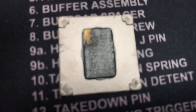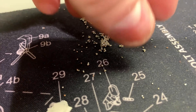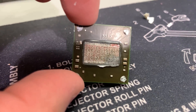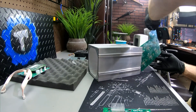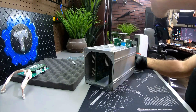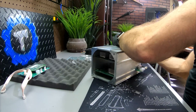Taking a look at the top of what appears to be an IHS — since there's a chip thermally adhered to the top of it — we can clearly see that the chips being used are the Xilinx Kintex 7 series, XC7K325T. A quick Google search brought me to DigiKey, where these chips retail for $935 a piece, which would make no sense considering there are 12 of them in this $2,500 miner. So I reached out to Hashaltcoin and another expert FPGA witness about these chips.